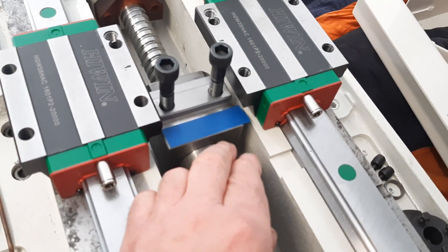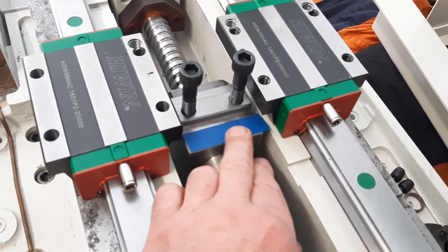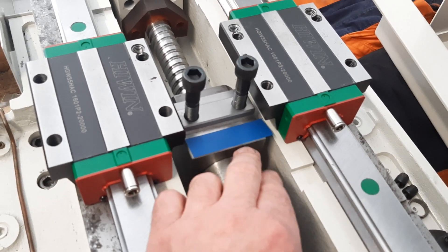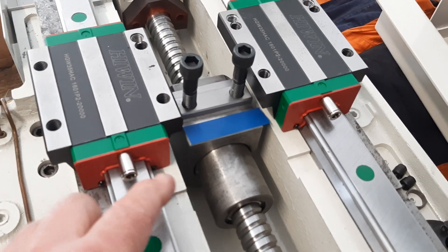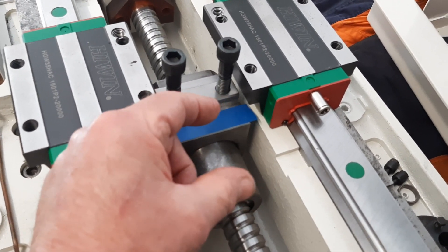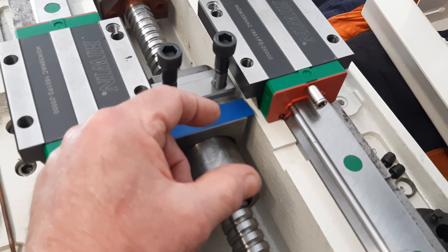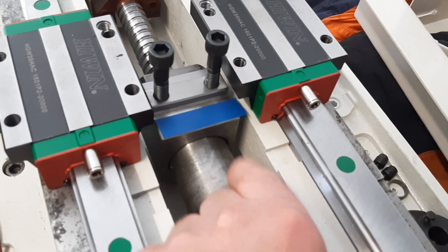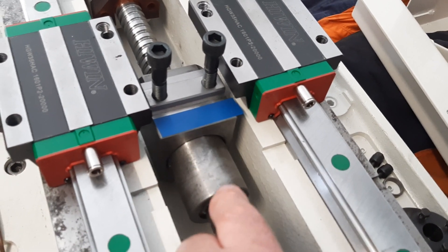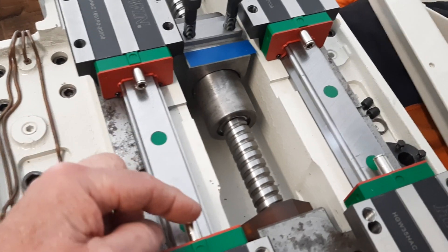That lube system I was talking about for the actual ball screw - I haven't changed that where that blue tape is. Those two oil lines will feed this ball screw. And then as I was saying, you have this block that was just in front of where this mounts on, where those oil lines were coming through. There's that manifold that I've made. So you have a line coming out and it'll tee across to each one - that tee piece in the middle there will feed each block.